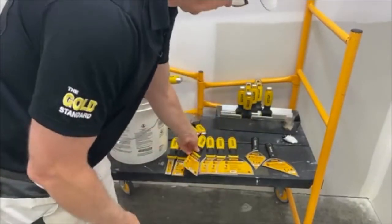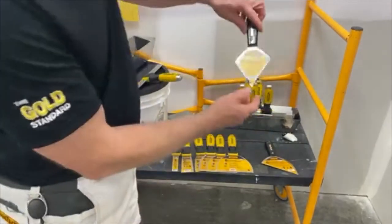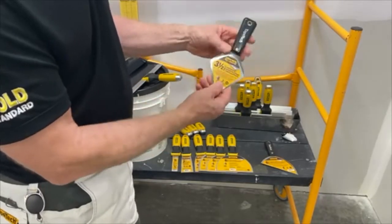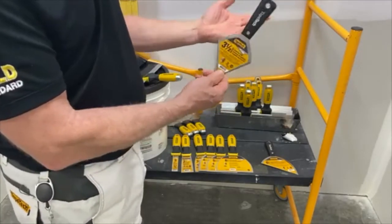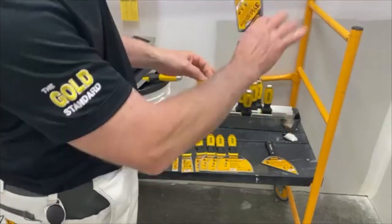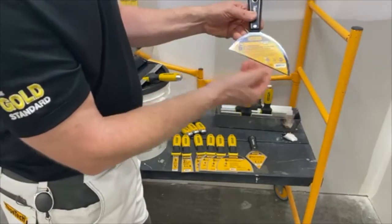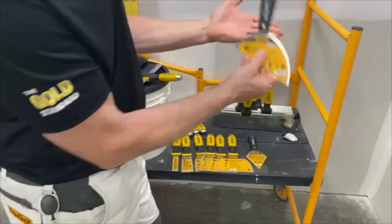The ergonomic grip is the same with all the knives. And then you have the four, five, and six. We do have a pointing knife for ceilings or odd angles, off angles. This is carbon steel, it's a blue steel as well — this one is not stainless. This grip is a standard basic grip. It's not a knife you really use a lot, so we just put a basic handle on that because it's just smaller to get into smaller areas. And then you have the clip knife — if you have a tray ceiling or an offset ceiling, it's a specialty knife for that. Blue steel, basic handle as well on that.